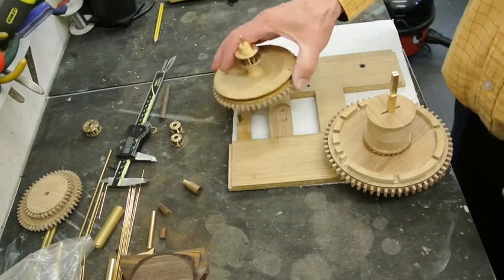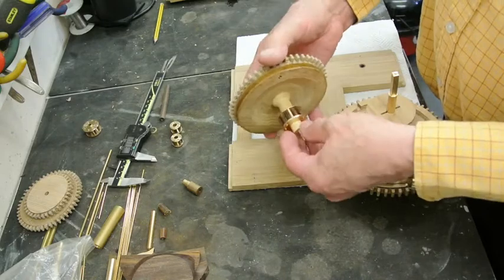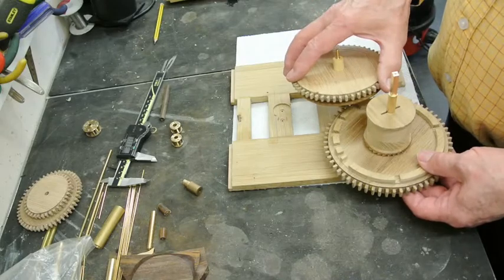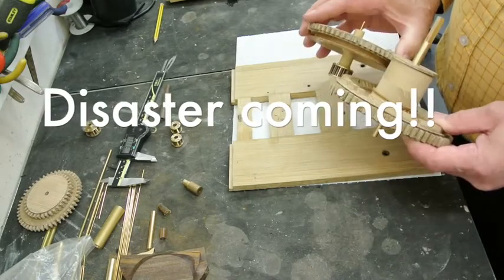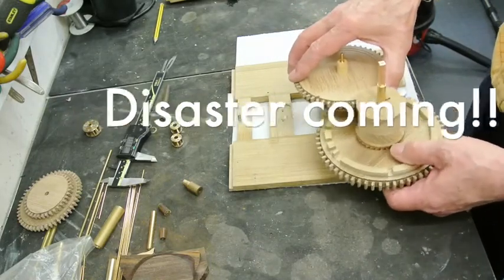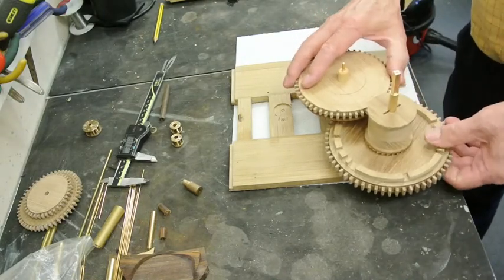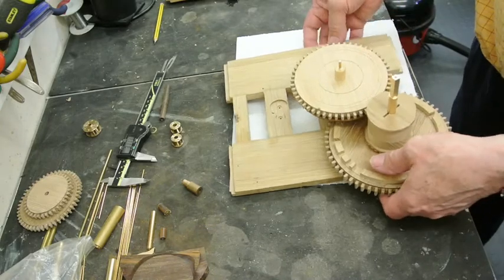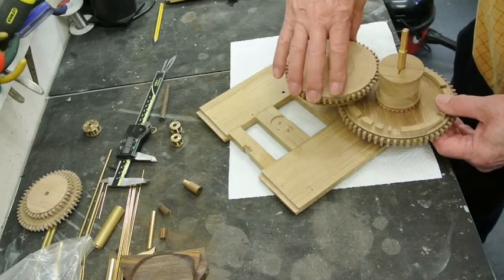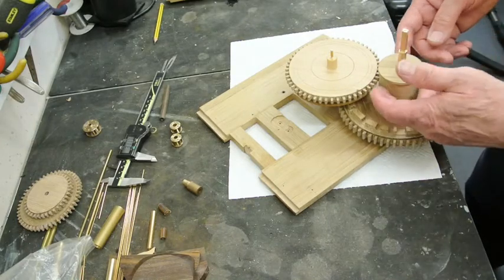I just finished off the second arbor and wheel complete. Very pleased with it, very nice depthing, until I tried to fit the wheel and the great wheel together in the final position. And they sort of fit, but unfortunately this arbor and this arbor are too close together. And they're rubbing, and I've still got the winding string to put round here. So